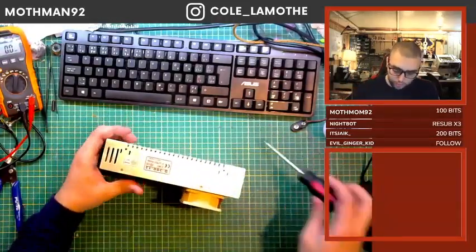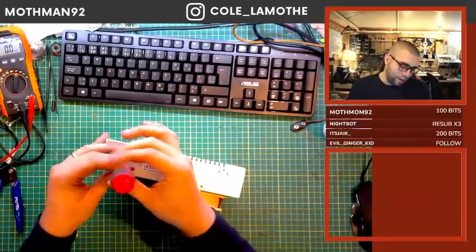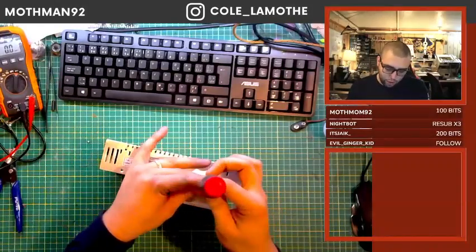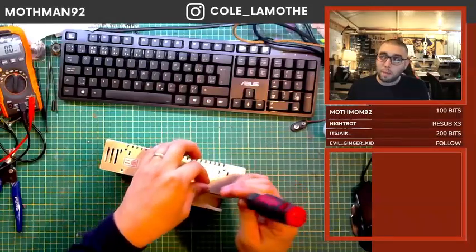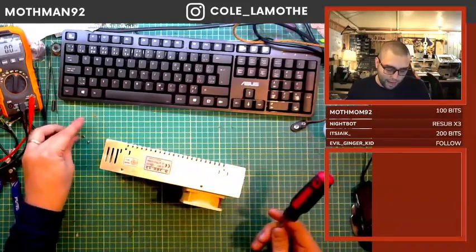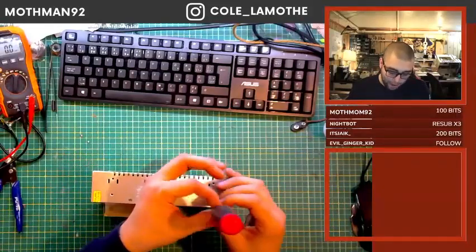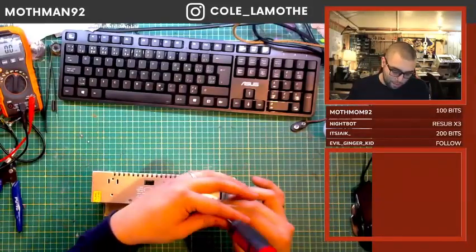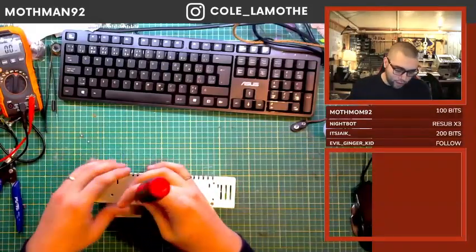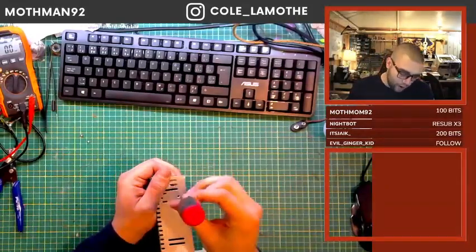So, what I did is I turned on my 3D printer, and I went, okay, if it is a thermal issue, generally, these printers can't tell you. If it's the main board, you might have some kind of warning system built in. OctoPrint will be able to tell me my Raspberry Pi temperature, so if the Raspberry Pi that's driving it is overheating, I'll know. But like the main board, I'll have no idea. I'll have no idea if this power supply is overheating, because there is no control signal to communicate between the two.